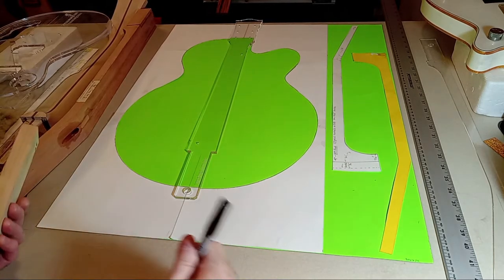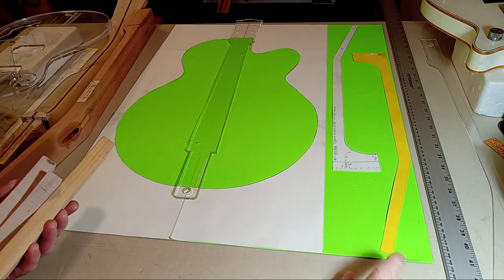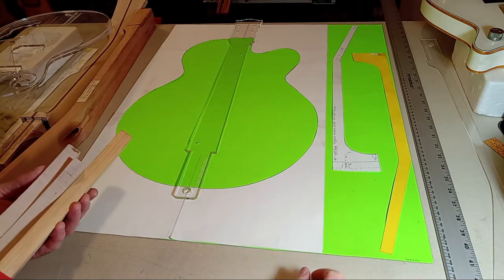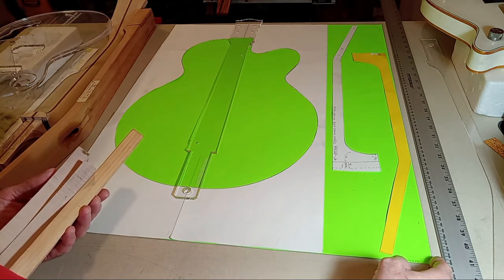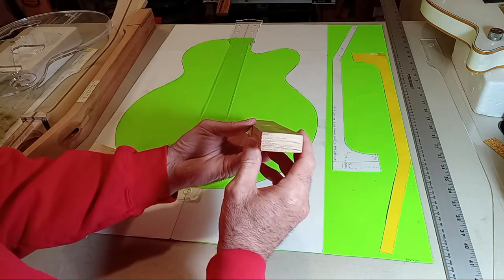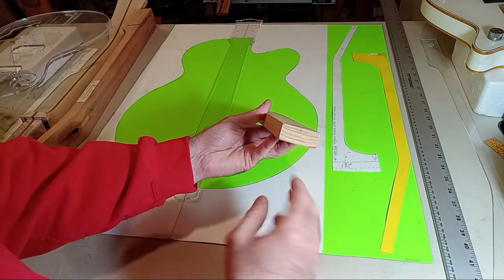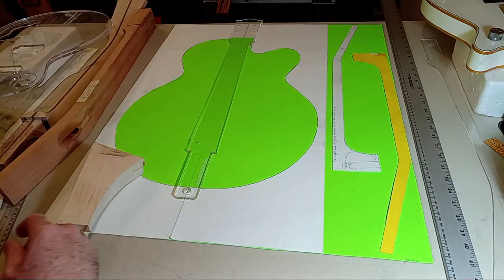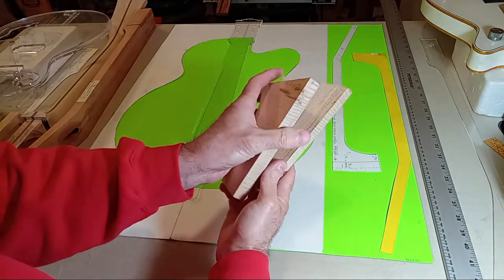The green area you see in front of us is basically a one-by-six, 28 inches long. Nominally it's a one-by-six, but actually it's three-quarters of an inch thick, five-and-a-half inches wide, by a true 28 inches long. The material you want to buy is what's called plain sawn or flat sawn — that refers to how the growth rings run through the board.